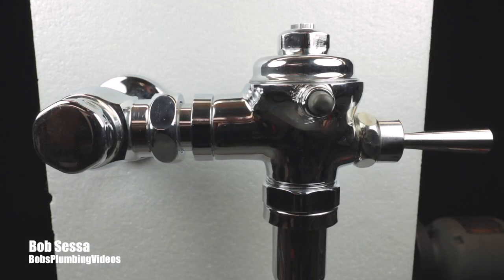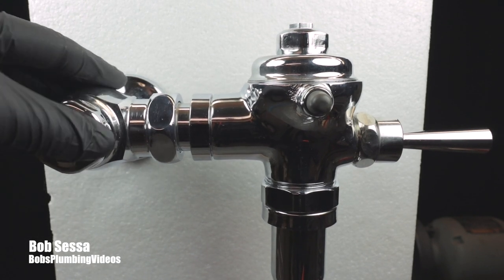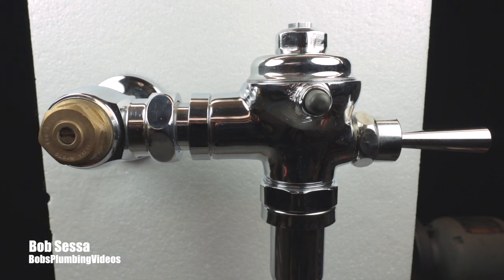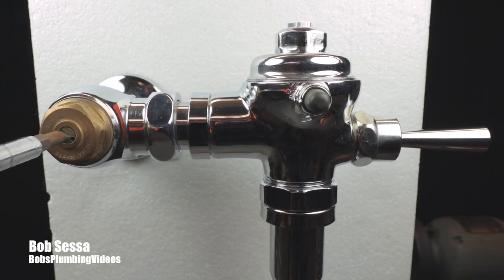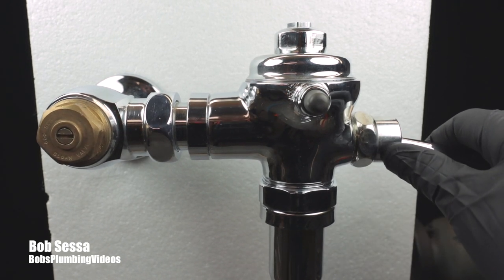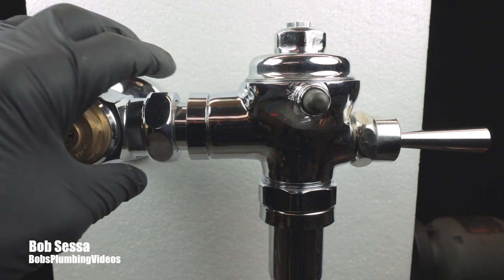For the purpose of this video I just want to walk you through the steps. If you're going to remove the head of this flushometer, the water has to be shut off — it has to be shut off at the source. This is the main incoming water supply. In this case there's just a decorative cover, and underneath this cover you're going to see a little screw. Turn it clockwise all the way until it stops. After you do that, hit the handle to relieve the pressure inside the flushometer and get all that water to migrate down to the bowl. Then stay there a second and listen to make absolutely sure there's no incoming water.